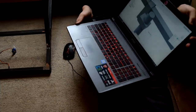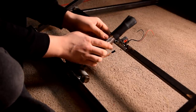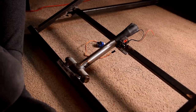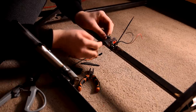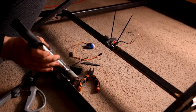However, I designed a servo holder and printed it, and in place of the handle, I welded a piece of steel flat bar. Now I'm sure that nothing will come off. I put a piece of rubber on the tube, which I had cut from an old inner tube, to reduce noise. I attached another, thicker piece with ties to reduce the force with which the pipe will hit the steel profile.